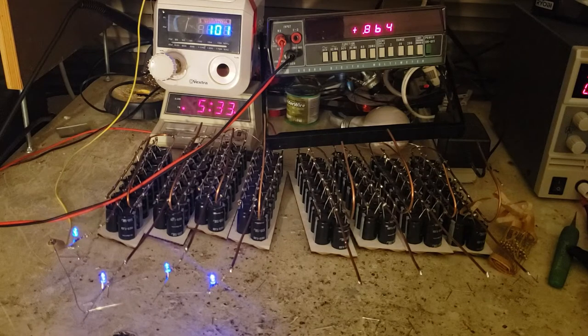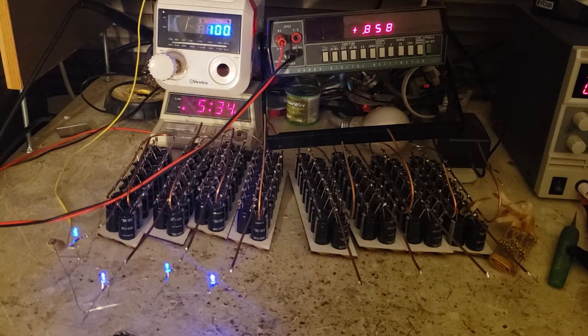And we're back. I only hooked up 4 of these little glowing charge indicator bleeder resistor things because I didn't want to spend a ton of components and time on just a couple hours of passive work. So I'll do 4 of these at a time. Same setup as before, currents in milliamps. We're at 0.85 milliamps right now. Soaking at 100 volts, we'll take it up to 330.